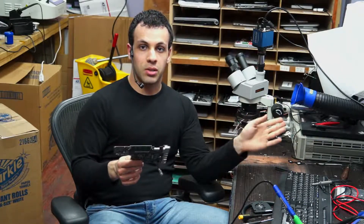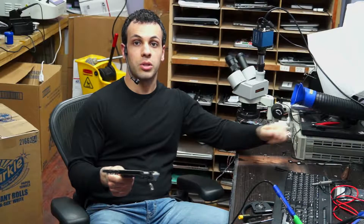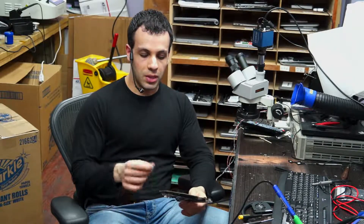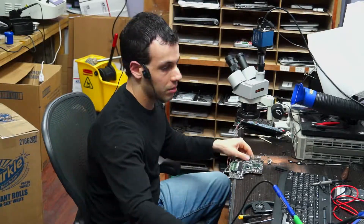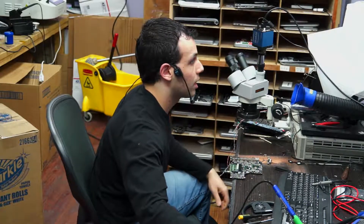Before I even got my short tester — this power supply I use for finding shorts in a motherboard, you can see what I do with that in a previous video on how to find a short in a motherboard without a $6,000 camera — what I noticed is that my CPU heatsink was getting hot. The voltage was actually being brought down. The charger is kind of smart: if there's a short to ground, it's not going to keep trying to create 12 volts into it — it lowers it to 1.7. At that 1.7 volts, my heatsink was getting hot, which meant that my CPU had something wrong with it.